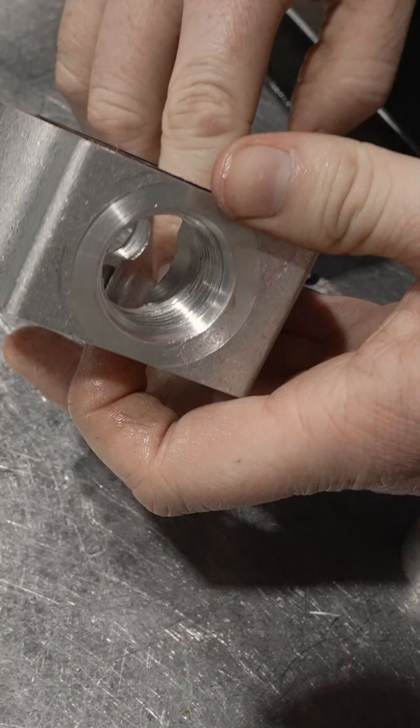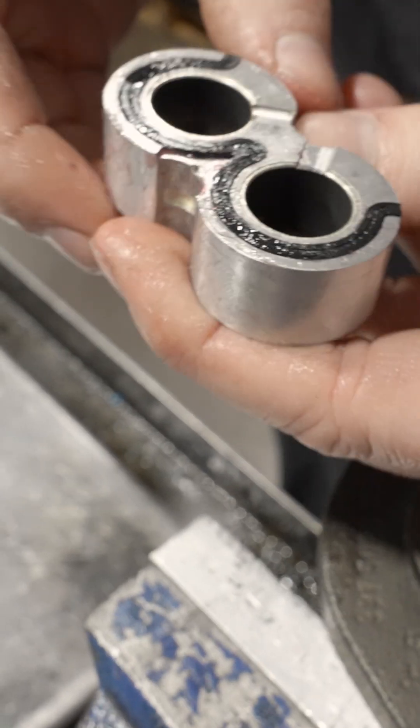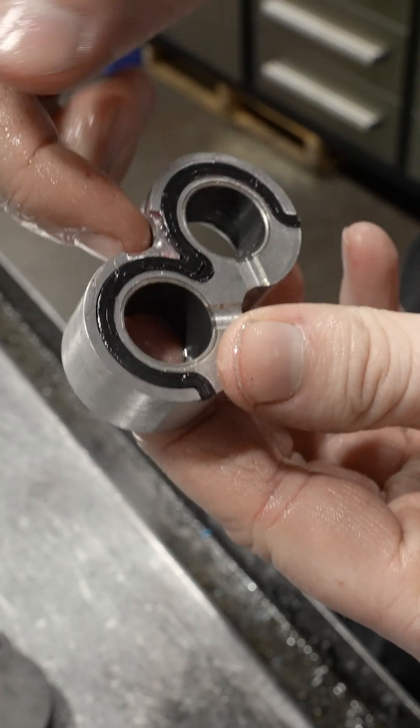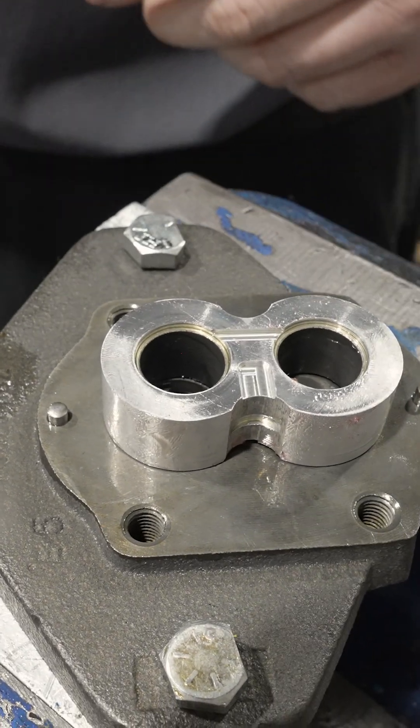Some hydraulic oil on the insides of the gear housing. You have to be aware of which side is which — so this is the inlet, the outlet. So high pressure, low pressure. Clockwise is in that orientation.